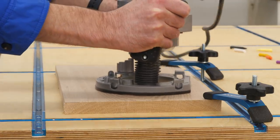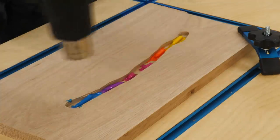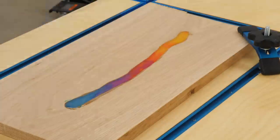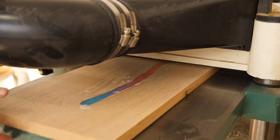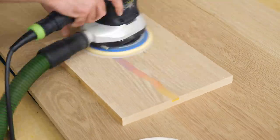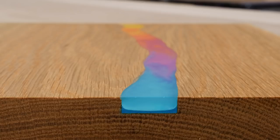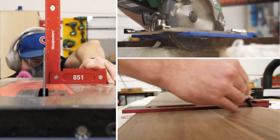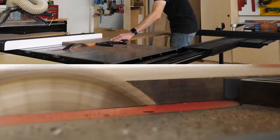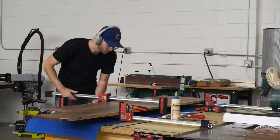The first thing that I did was make a small version to test the technique that I planned on using, just to make sure that it would work before I spent several days doing the real thing. I thought the test piece came out pretty good, so I decided to get started on the real thing. I started by prepping and gluing two boards together so that I could make my top, which is gonna be about 18 inches wide and 60 inches long. After that set up overnight, I was ready to start routing my groove and melting my crayons.